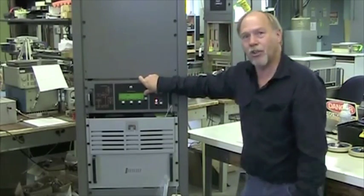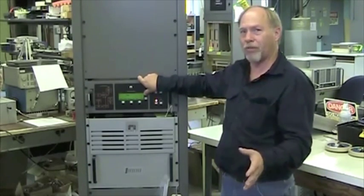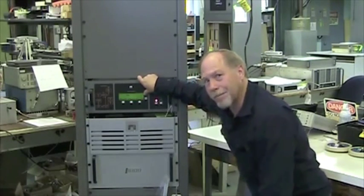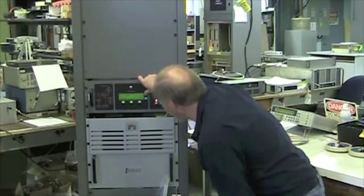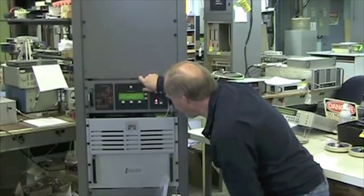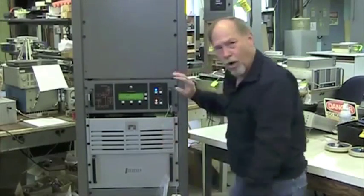This transmitter functions on a switching power supply, and at approximately 200 watts, the B plus will switch from 150 to about 245, if everything is happy. And it did that. And it was fast. Fast here, 5166. Okay, so at 222, this power supply switched to 245. And the DC current dropped.